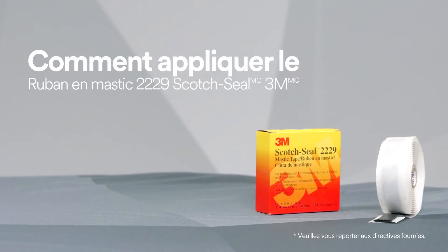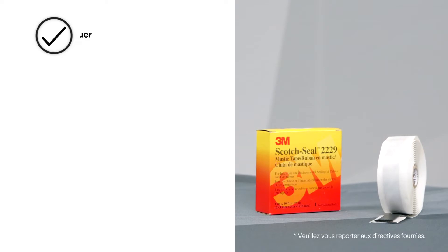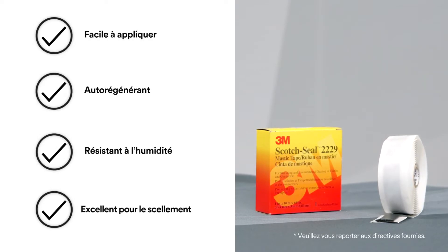To help protect against moisture, use 3M Scotch Seal Mastic Tape 2229, because it provides excellent adhesion and sealing to metals, rubbers, synthetic cable insulations and jackets, as well as electrical insulating properties.